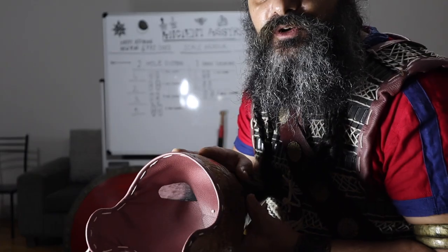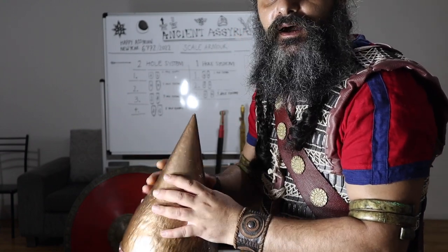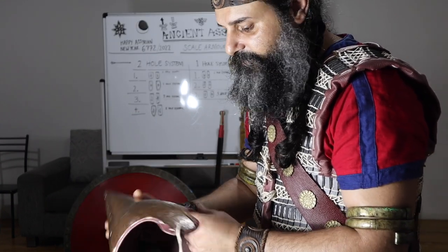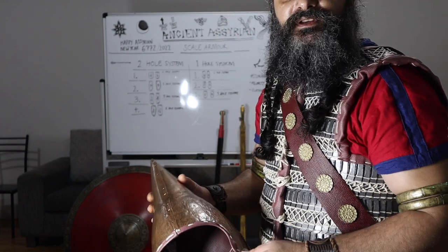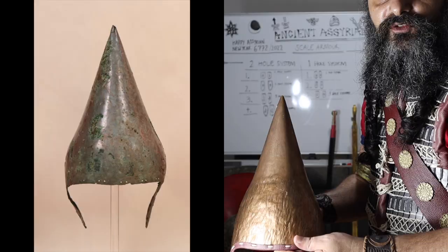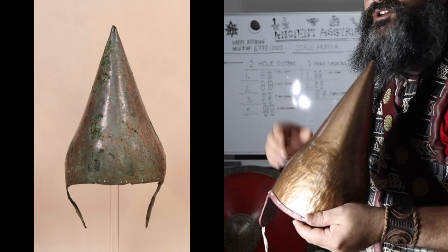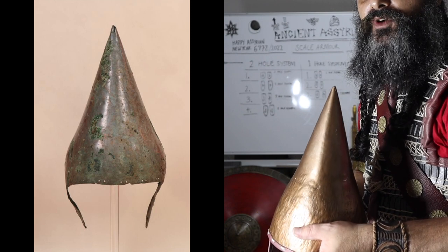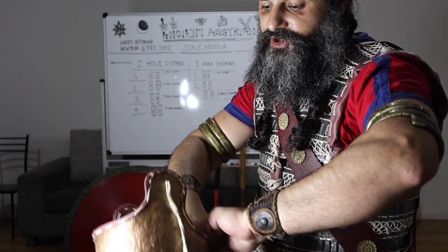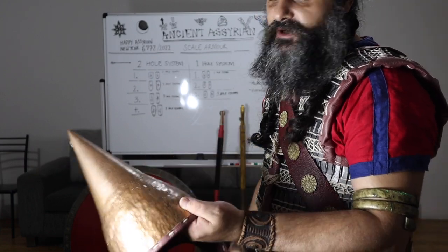I don't know if you can get a glimpse of what it is, but you can see the aluminium on the inside, and here I've spray painted it a coppery color, and then just given it an antiquated finish. So surprisingly, with very little metalwork experience, I was capable of pulling off that design, and it's all in the actual template that you cut from the sheet metal, which allows you then to just dish out this to create that curve, and it also hardens the metal up quite considerably.